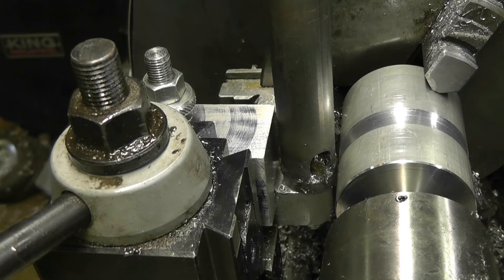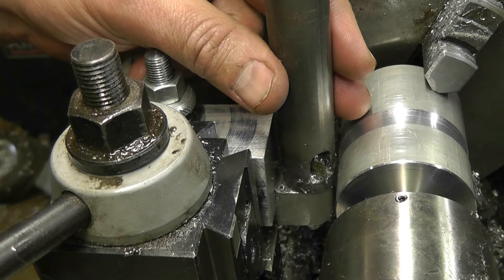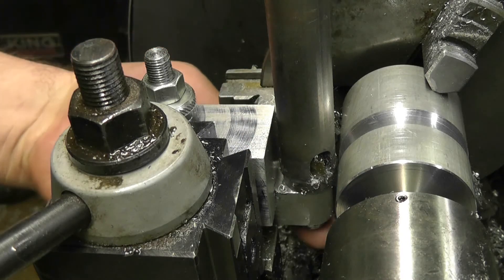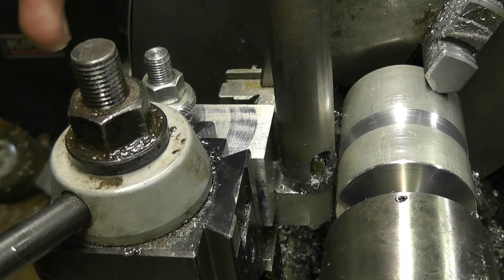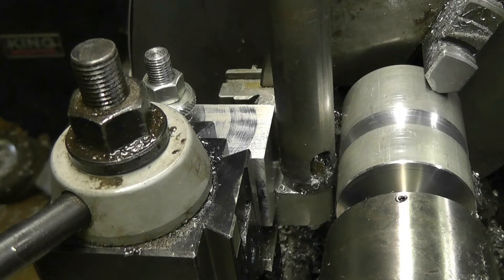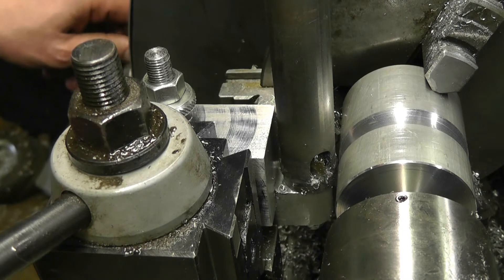Okay guys, so far the results of inverting the tool bit are quite promising. I was a little worried because the bulk of the thrust is pushing upwards on the tool, which would tend to lift it off and put all the pressure on the nylock holding my threaded rod in the bottom. But it seems to be doing quite well. I took a 20 thou cut, all the chips fell downwards. There were a few big stringy pieces that wrapped around but didn't interfere with the cut. So I'm going to take another 20 thou cut — just have to remember to turn the lathe on backwards. A couple of times I turned it on forwards and couldn't figure out what was going on.